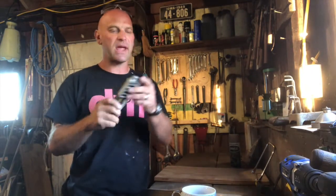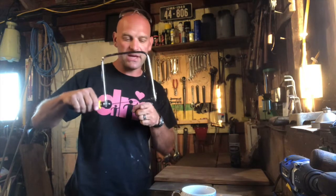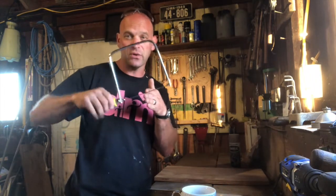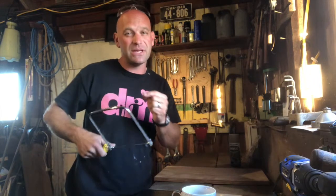Saws are super handy and different saws are meant for different purposes. Right here I have four or ten saws hanging and they're meant for different purposes, so a saw is a super useful tool. Make sure when you saw, you're not trying to put all the force of your whole body into the sawing motion. A saw works best when it goes back and forth at a rapid pace — the more teeth you can connect to that material, the faster your sawing will go. If you're pressing down really hard, all you're going to do is wear yourself out. Sawing back and forth at a rapid pace without pushing down too hard, you're going to get through it a lot better and it's going to be a lot cleaner cut.